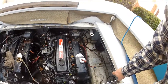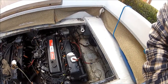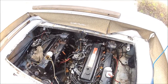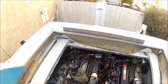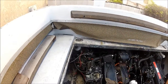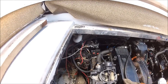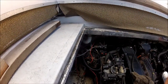This thing did not have a blower in it, which is another no-no, so I'm going to have to put a new blower in it. And then the trim system — I'm going to have to get creative and use some of my electrical and avionics background to figure out the wiring for the trim systems for the outdrives, and figure out how we're going to wire those and incorporate the trim indication capabilities that we've got.